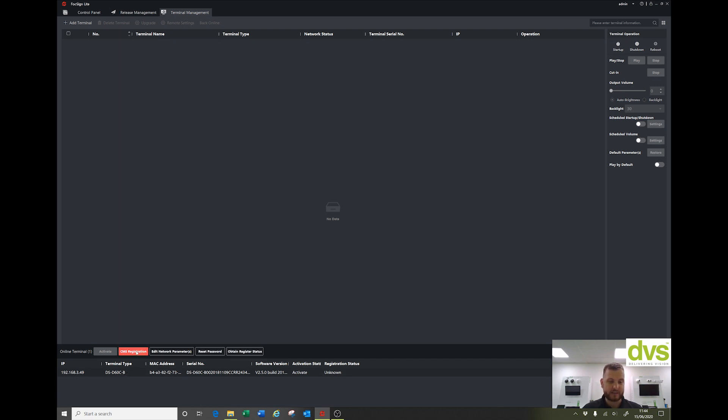Highlight the device and click CMS Registration. You can either have a PC locally that supports these devices or the PC could be off-site — if off-site you'll need port forwarding. This PC will need a static external IP address, and you assign the IP address to the units externally to point them to this software so they can be centrally managed. One software installation can manage multiple deployments.